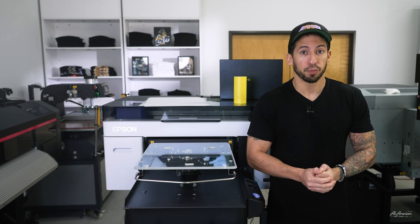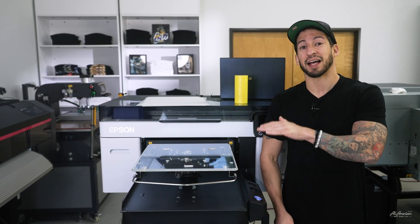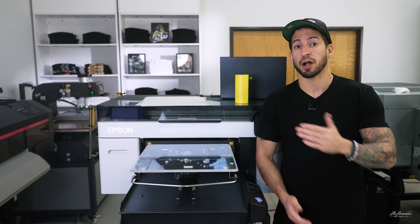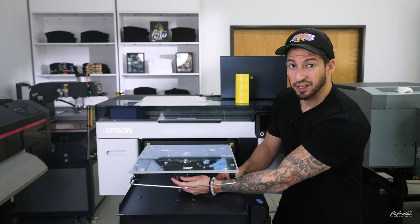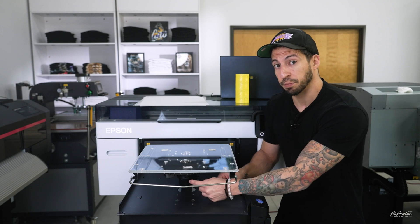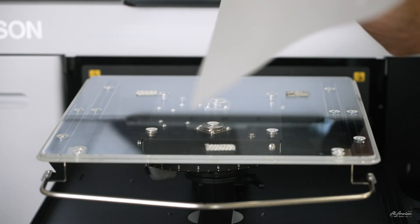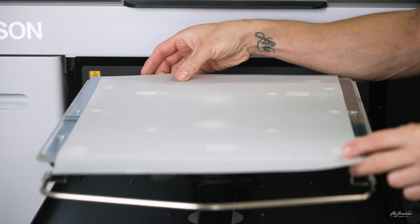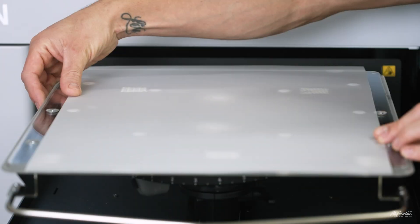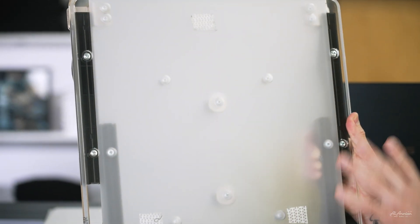Always be sure to follow your machine's proper opening day procedures to make sure your first print comes out perfect. Let's set up the film. We're going to address the platen height — it should always be at the highest level, level P, for optimum precision. Drop the lever to the vertical position and slide the height adjuster all the way to the left so it's on level P. Lock that platen height into position by taking that same lever and changing it horizontal. Take our media print side facing up, and using the hardware on the platen, find a nice center point for placing our film and apply a little bit of pressure to the platen grip strips. These three key areas keep the film in place as it's fed back and forth in the machine.